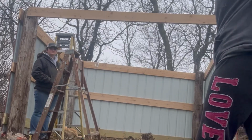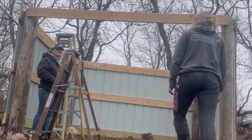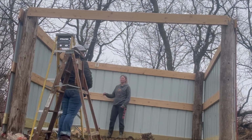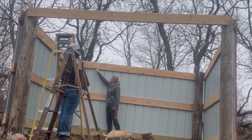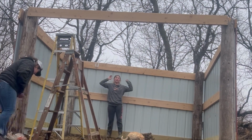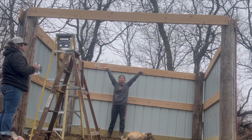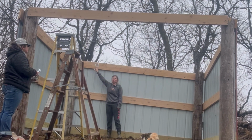Okay, Mel's helping me today. We're hopefully gonna finish this thing. And she's not gonna talk because she lost her voice, but right now we're doing the roof joists. So I don't know if you can see this from there, but we're hanging these joist hangers, what they're called. We're hanging these first so that we can put our 2x6s across the top. And then we'll do 1x's across the top again, the opposite direction. We've got them all marked out already. We just need to nail them in.